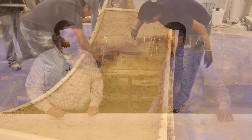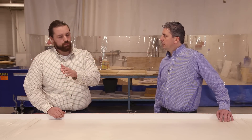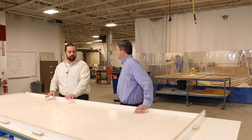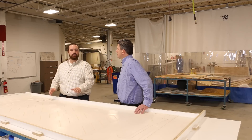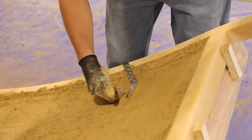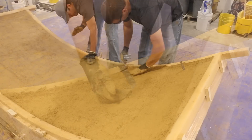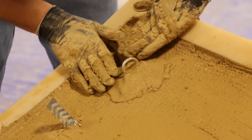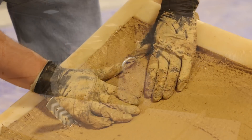Was there any additional support added for the panels to hold them together? In the panel design itself, the only material added to the mix design is the glass fiber. But because these panels are ultimately going to get lashed and connected together, we embedded anchors and U-bolts into the back of the panels. We're going to get into that further in part two, as it touches more on the structural application.